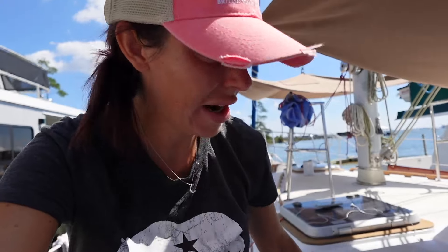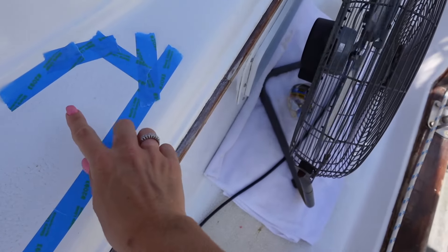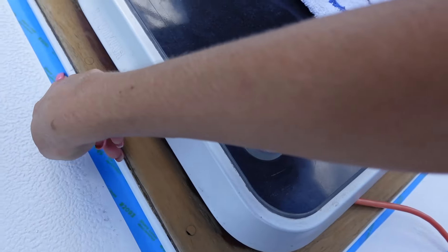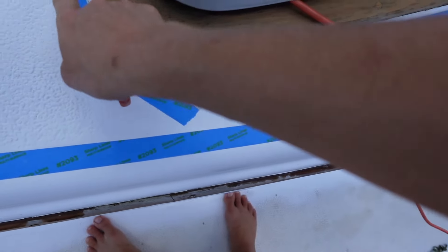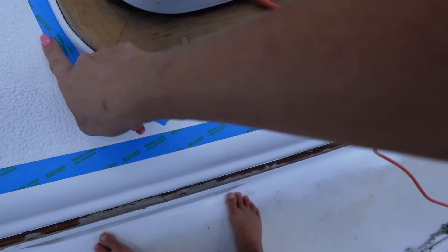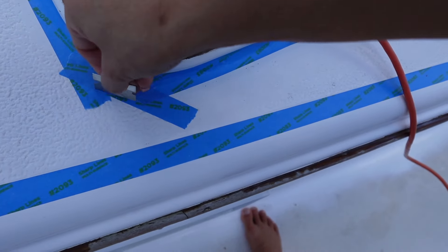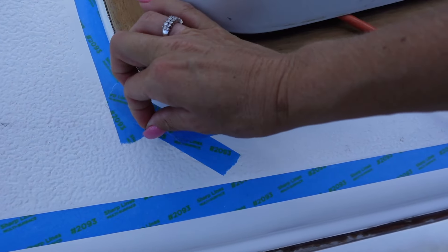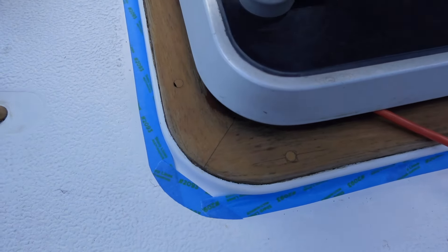I don't ever take medicine, but I had to give in because I really want this done. We have a really good weather window. So this is where I'm at with a corner when you're going to roll Kiwi Grip. Always remember when you're using tape to tape off your non-skid, you tape the soft side. And then your corners, you can get sloppy because what you're going to do is follow the non-skid. And there you go — there's your clean edge.